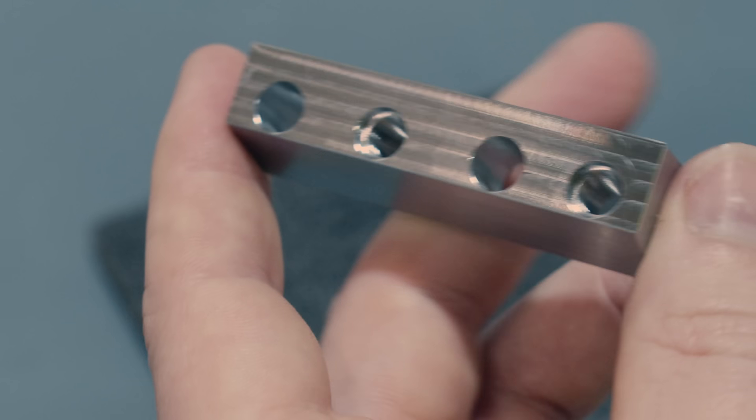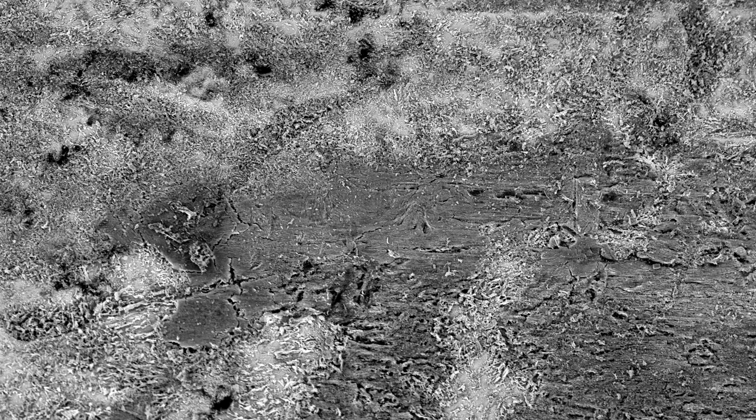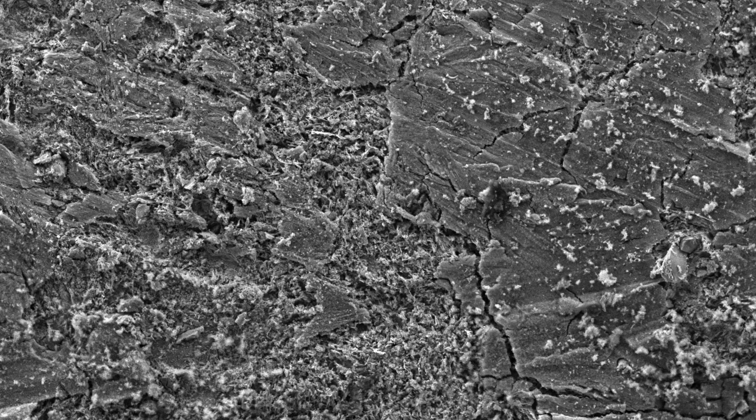Here is the plain steel surface prior to coating. Not much to see — it's basically a flat metal surface with some light tool marks from the end mill. The darker splotches are mostly organic contaminants that didn't get cleaned off entirely. In contrast, this is the phosphate coated surface, and we can see that it's much rougher than before. The surface is basically a rough forest of nodules, cracks, and crystal growth.